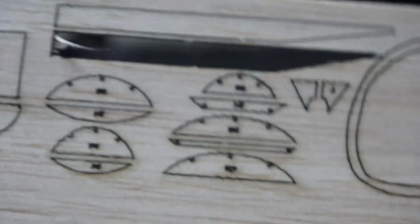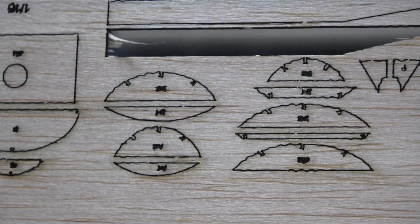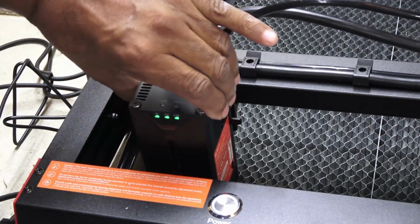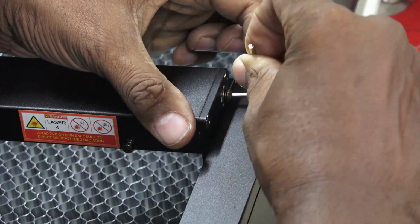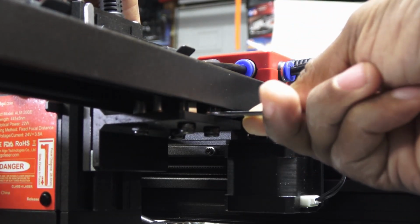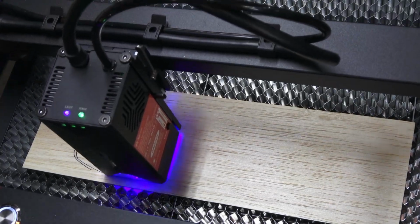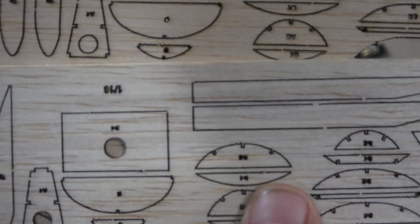And then I saw something strange. Many of the lines were really squiggly. What the heck? I wonder if the head was loose. So I checked the belt tensions and roller wheels, whose friction can be adjusted. That helped, but only very slightly.